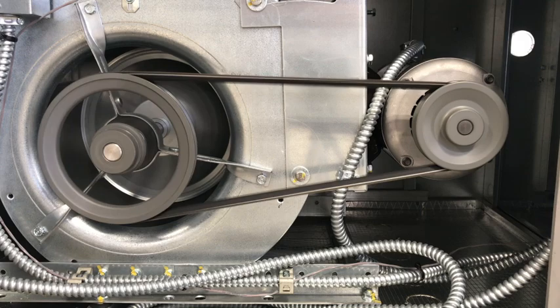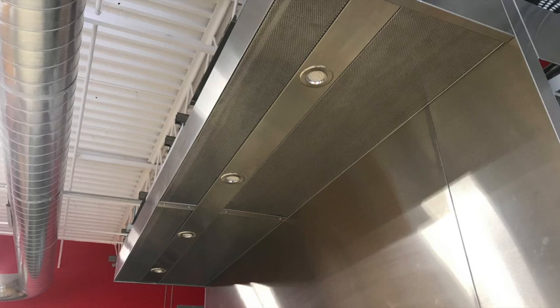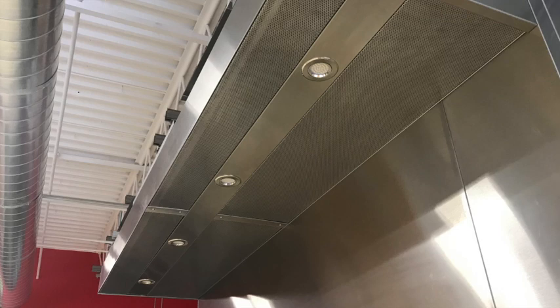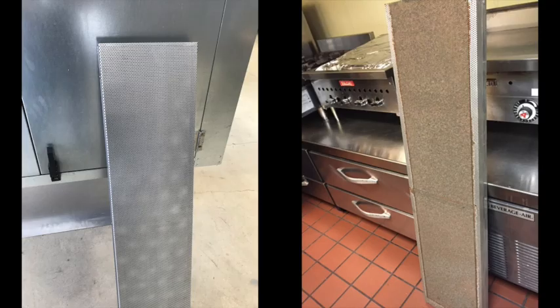The last piece of the puzzle is the outlet, ductwork, and registers. A restriction here can cause low airflow as well. In our kitchen ventilation system, the makeup air is usually delivered to the hood through the perforated supply plenum, or PSP. This is made up of two layers of perforated sheet metal with about a 3-inch gap in between. Looks can be deceiving here — the PSP can look clean from the bottom while the top side can become completely clogged with dust.